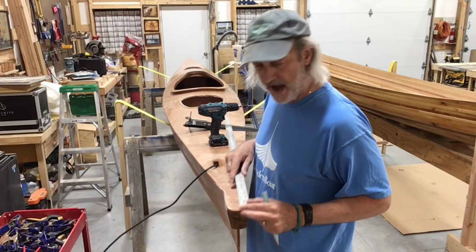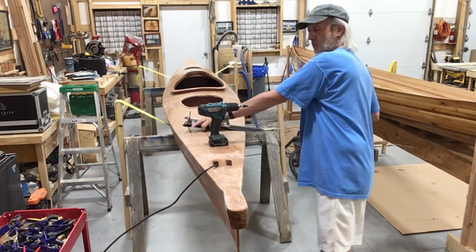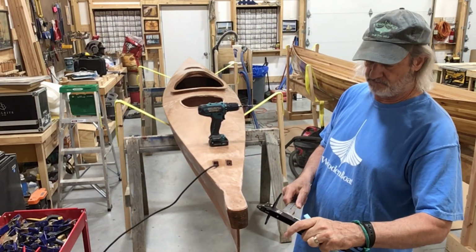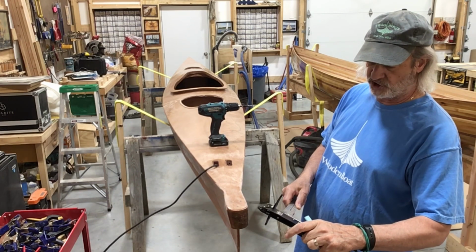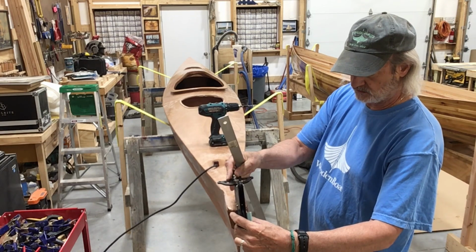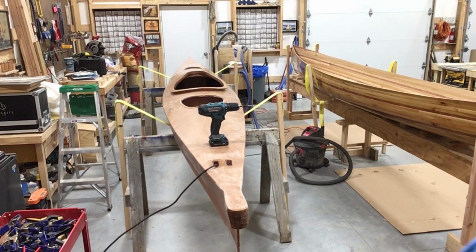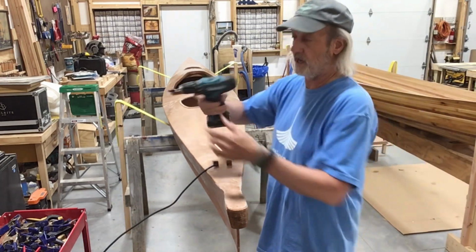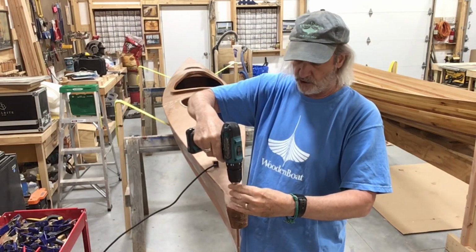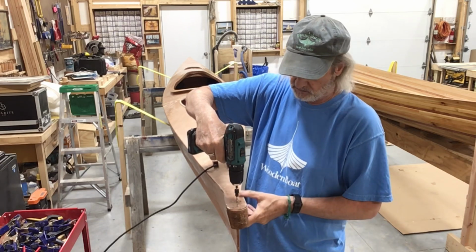We're about 1 inch back from the very end. And this has got a distance here of about 1.25 inches, so we should have 1/4 inch. Yeah, that's going to be good. Again, I'm drilling a pilot hole with the real sharp, pointy part of this before I go putting the 3/8 in there. Now this is oak. This may be a little tricky.